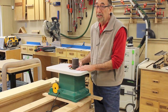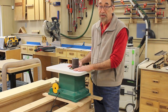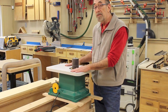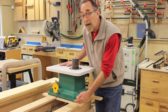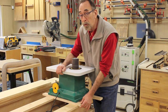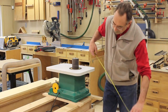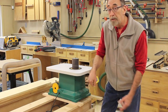After making a wish list, the next step is to get the critical dimensions before you finish a design of a project. For me, a critical dimension is working height. Now this was easy because it's easy to move around. Right now I have the spindle sander sitting on top of my I-beam work supports. I wound up putting a couple of 3/4 inch spacers underneath it and got the height pretty much right where I'd like it. It measures from the floor to the base 31 inches.